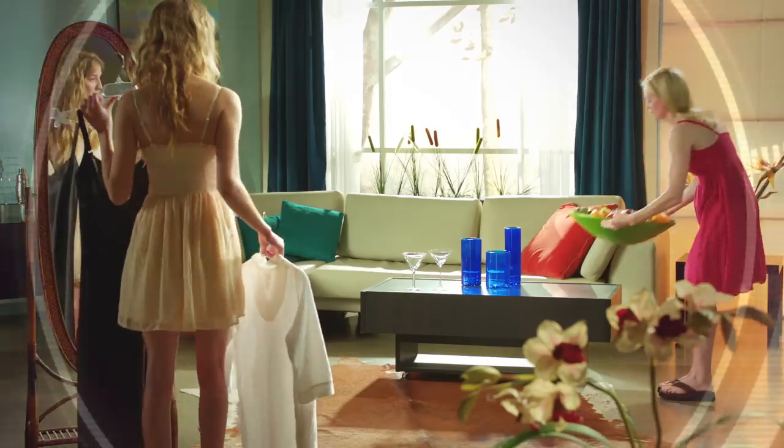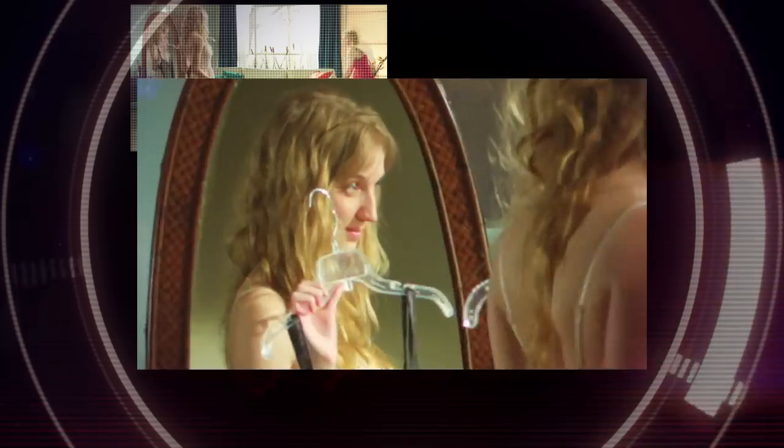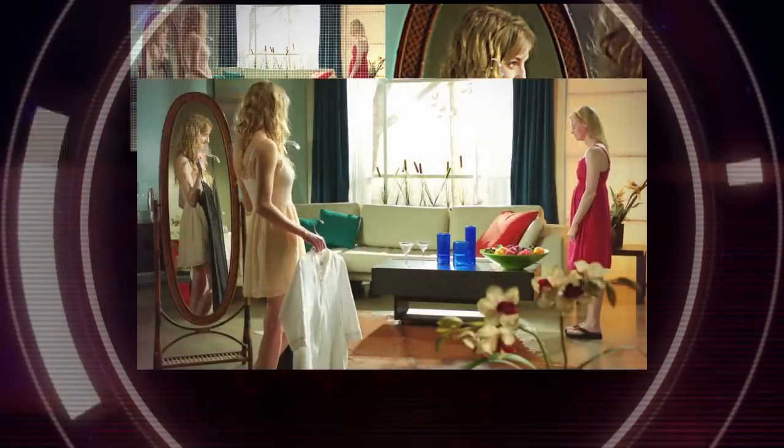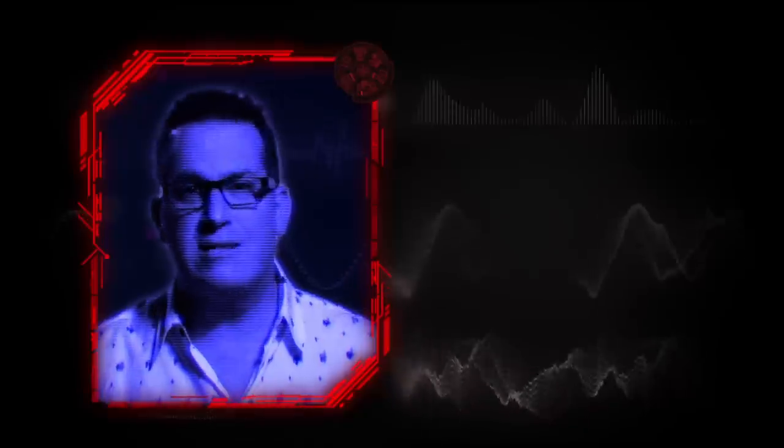Some cameras use noise reduction as part of their image processing pipeline to create a cleaner image, but this process often creates a softer image that can affect the sharpness. The perceived sharpness of an image is influenced by many factors. There is the actual resolution of the camera, the acuteness or edge contrast of an image, the depth of field of a scene, the resolving power of the lens, the use of an optical low-pass filter, and the compression of the final image. These factors can work together and sometimes against each other, and may affect how sharp an image looks when viewed.